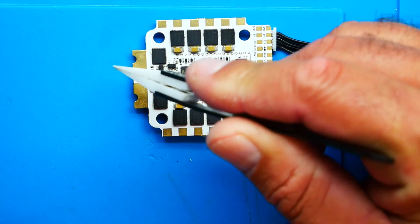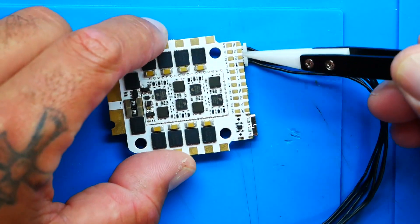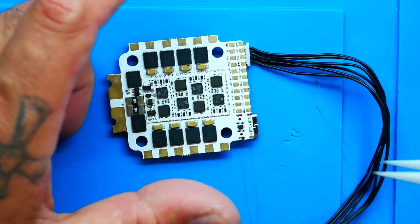You go fly, because that's it. Now, let's say you want to run this board and you are not a DJI pilot — that's great, doesn't matter at all. Go ahead and wire up your XT60, solder up your motors, and right here is all of the wiring you need to connect your VTX, your camera, and your receiver. Get in the sky, let's go.